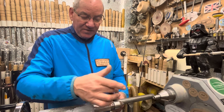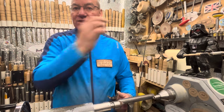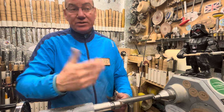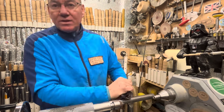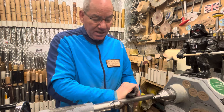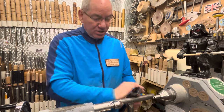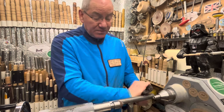And if anything hits that, you normally might have a bit of a knot. It's harder because it's end grain you're going on to when it comes down. A knot is always end grain. If you're here, it will try and do that. If you're here, it will just do that. It just pushes it there. That's not a catch, you can handle that. The most it can do is push you away from the wood. It stops cutting.